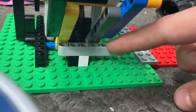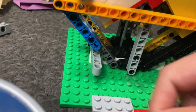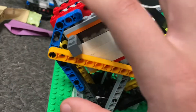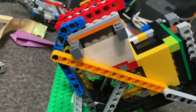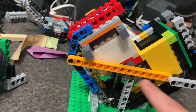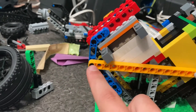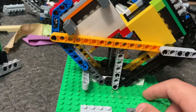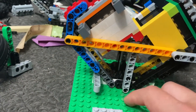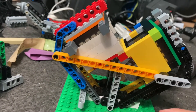On the sides we actually have these pieces here, which really help the engine be stable. Without them, I could actually move the engine and it could tilt on its beams. It's not really possible to secure it any other way because this central beam that goes across is the only measurement that's compatible with the LEGO spacing — anywhere below here is not compatible, so you can't put any beams across and have them fit. That's why I put it all the way up here to make sure it's stable enough, because otherwise the cylinders would just flop down.